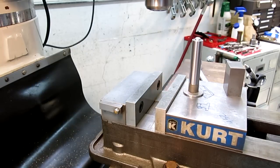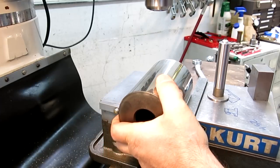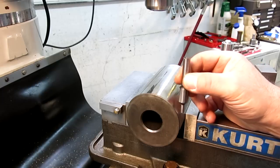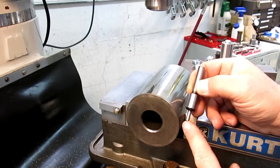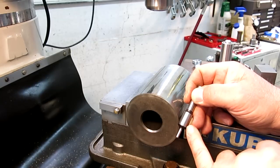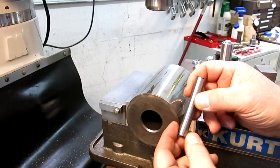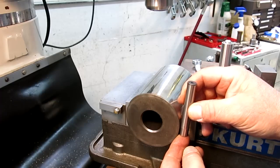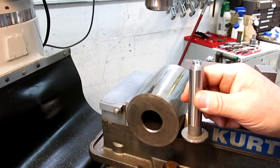So there's our edge finder. Just to clarify what I was saying — say you had something like this big Mamaluca here and your normal edge finder, and you want to pick up the side of that. You can see you're not going to be able to do that with a standard — this is called a Super Jump, actually a really nice edge finder. A smaller diameter one might make it. This is a General, half-inch diameter with a half-inch diameter tip, about 13 millimeters roughly. You can catch this with that one too.